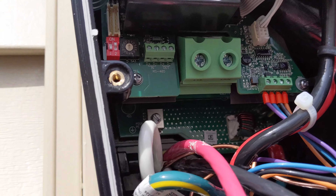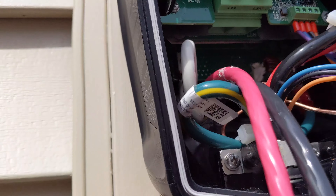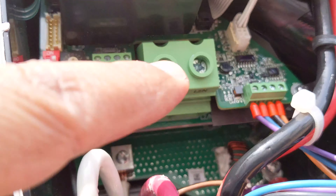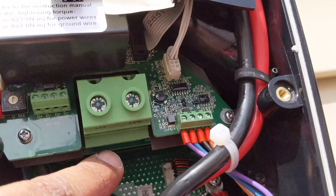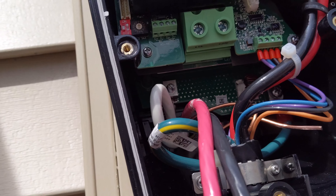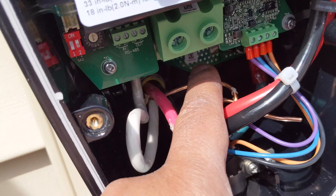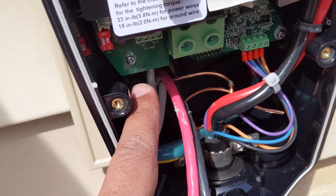When you start to connect your wire, these wires are very thick so you're really gonna have to manipulate them to get them in. You have an L1 and L2 — these two — and the connection is underneath, so I'm gonna have to back this out a bit, trim this down, and get my L1 and L2 slipping right up in there. The ground is already hooked up. My white wire is gonna be my ground. You're gonna have an extra ground here — just cut it off, wrap it up, and stick it in the box. It's not gonna be used.